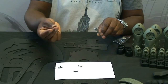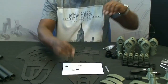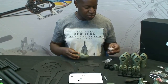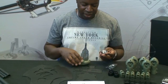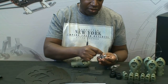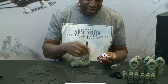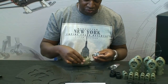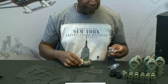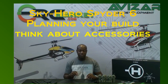You don't need to add Loctite onto the screw end as well as the point it will be screwed into. For motor mounts, you may need to use Loctite, but again it's very important to put only a small portion in the hole where the screw will go, and make sure you 100% clear away the excess Loctite before securing the screw inside the bottom of the motor.